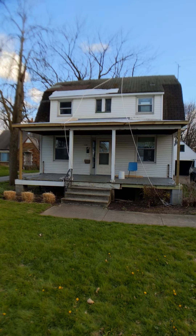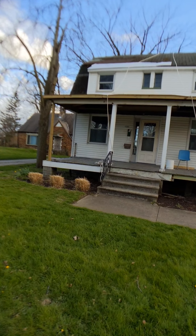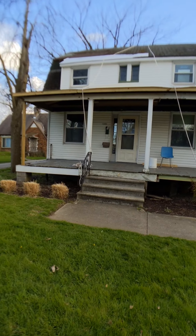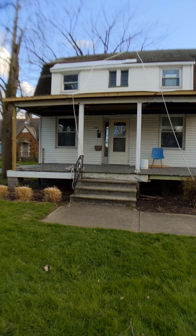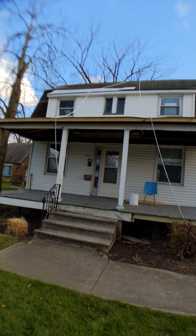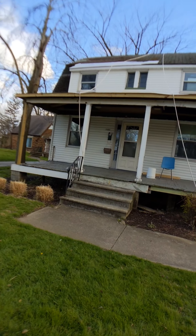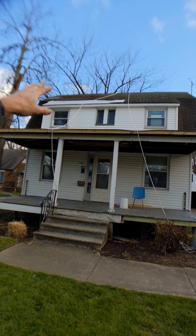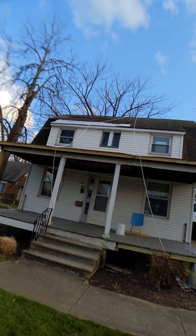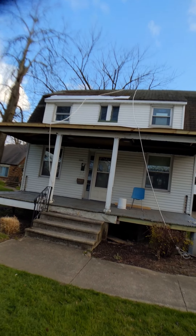It'll suffice until I can actually get the roof done. The porch is now in a functional state — the deck boards are kind of rotted but I put the new footing in over here and rebuilt the eave on the left side and got the waterproofing done up top. I'm down to like two minor tiny little drips, which are almost nothing, because trying to tie into those shingles up there is like trying to tie into 200-year-old paper — they just flake off.